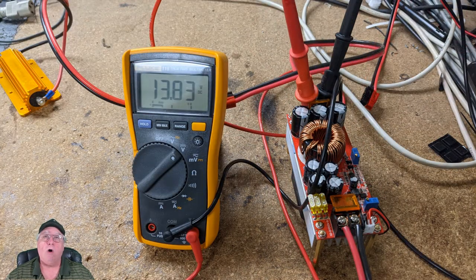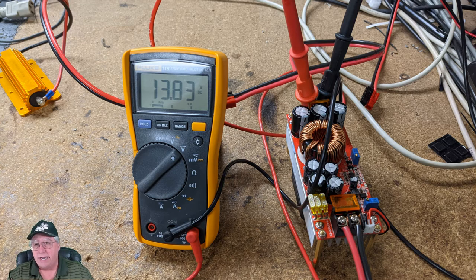Let's go ahead and toss the load and see what happens. So now I have the BFR plugged into the output of the power converter. The boost converter is putting out a perfect 13.8 volts — just about perfect, a little higher, but that's exactly where I want it. And I was just getting ready to pack this up when I said I wanted to see what the input voltage was, just to see how it's nice and consistent. So let's see what I'm actually putting into it — and this is where I got the shock.